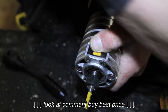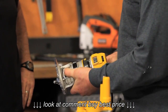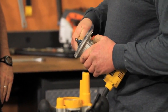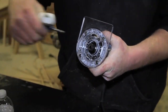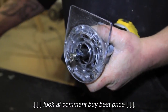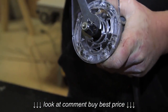Speaking of bits, let's talk about the bit change. Say you're using this setting right here — you just crank it all the way to the top. It's got a push button right here that locks it; spindle lock. You just lock it in and you can spin the bit right off. With two wrenches you have the leverage of two hands to really wrench it down. With this one you only have one, so you have to make sure you get it nice and tight — just be leery that it's tight.